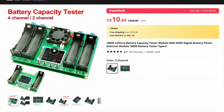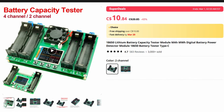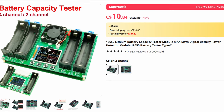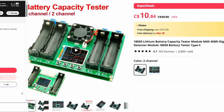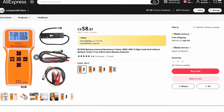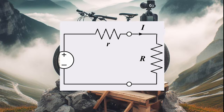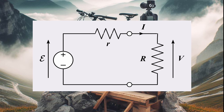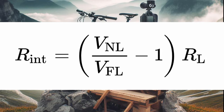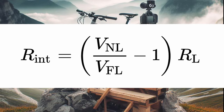You can also use a device like this to test for internal resistance — a valuable metric. However, units like this I've heard are not very reliable, with each different cartridge showing a different internal resistance for even the same battery, and sometimes testing the same battery twice gives different results. The more you spend, the better. This is a valuable thing to check because one battery with high internal resistance will pretty much limit your whole pack. There's also a method using a resistor and a formula: check voltage with no load, apply a known resistor, then use the formula. I'd definitely recommend this.